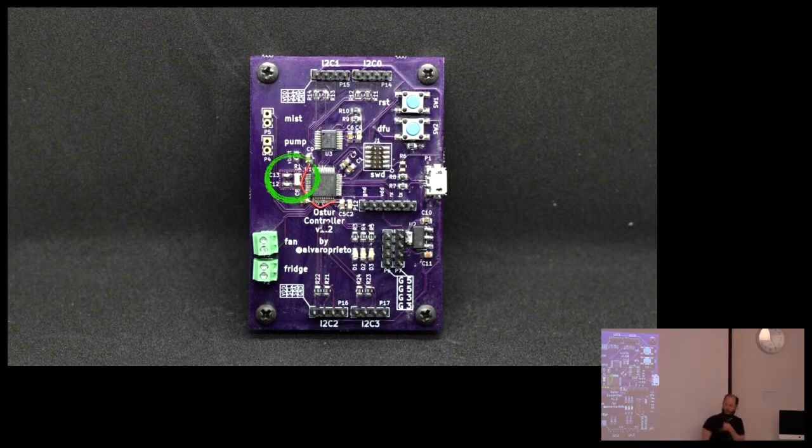And I redesigned it, and this is all vias. I basically went to the data sheet and did this exact reference design, which is like little ground vias in a different ground plane. Reference designs are great. Sometimes it's overkill, but it was fun to try that out. So this is just a smaller version of the board. Now I only have four channels because I didn't need any more. I don't have the selecting 5 volts, 3 volts because I converged on a particular sensor, the SHT31 from Sensirion. So yeah, it's just a little evolution of this board. You might notice some botch wires here. Oh, what's going on?